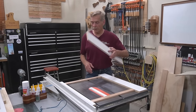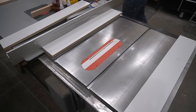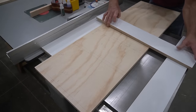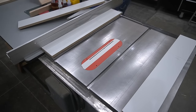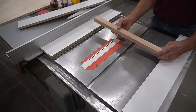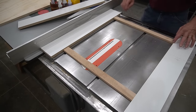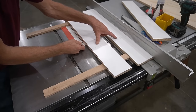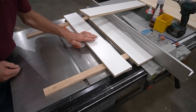I've got these melamine pieces set up here, so I'll bring the camera in close for the simple but key steps for assembling the jig. The first thing to keep in mind is that you want the space between the two pieces to be at least as wide as — preferably wider than — the widest piece you'll use the fixture for. My widest piece is 15 and a half inches, but I'm making the space about 19 and a half inches. I cut two sticks to exactly that spacing to keep the two pieces parallel as I build the fixture.